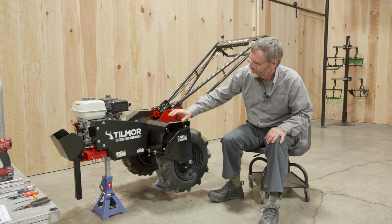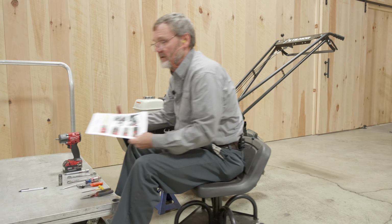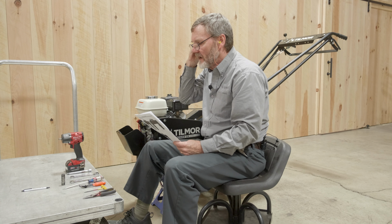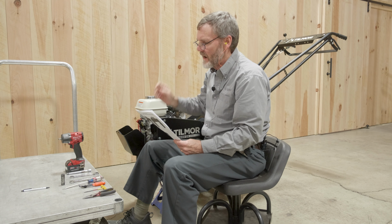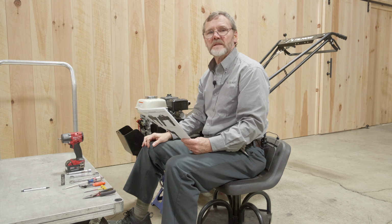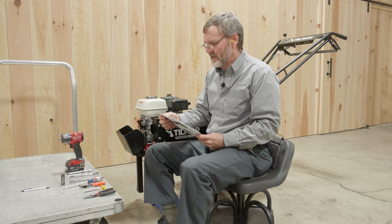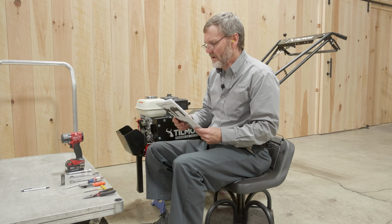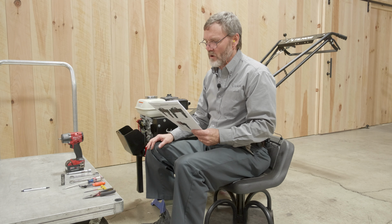Both wheels rotate. So now we're going to go to page 15 of your operator's manual. It talks about track width adjustment. So the wheels can be adjusted to the 3 different locations, narrow, mid, wide, in 4-inch increments to accommodate those different settings. So it'll be 2 inches per side as that moves outward. Wheel spacing dimensions are located in the specification section of this manual like we talked about. Ensure that the PowerOx 240B is securely supported.